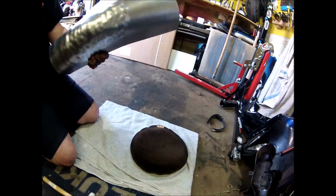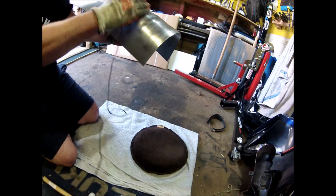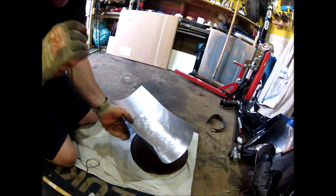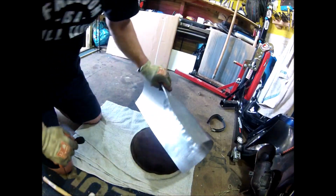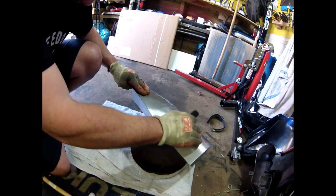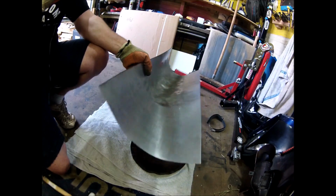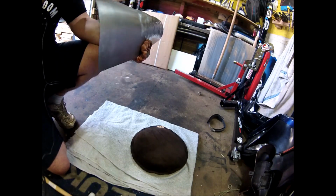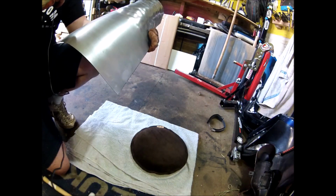Right, so that's pummeled for about halfway, and you can start to see the hump where you're stretching the metal through the middle. The sides want to fall in, so there's no hardship in opening that back up. But you can see it's just starting to develop. So a lot more whacking. Obviously it doesn't help that this is 1.2mm thick and it's quite a big sheet, so probably should have started out with a sledgehammer, but if you use steel on steel you run the risk of splitting the metal, so bossing mallet it is. So I'll carry on.